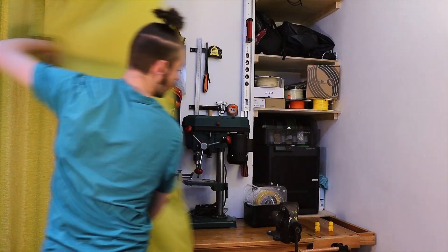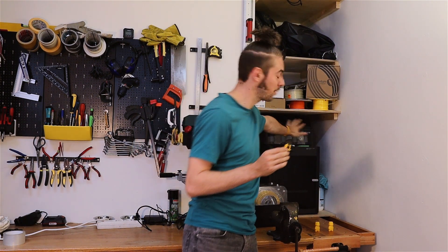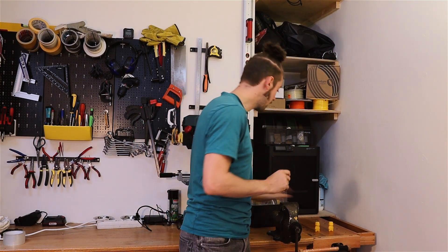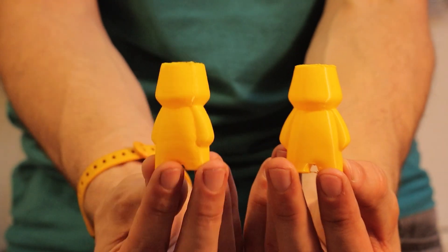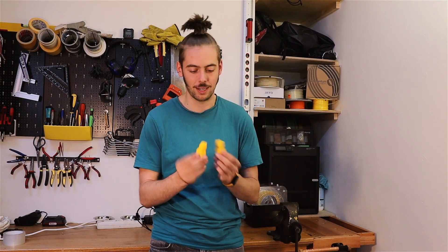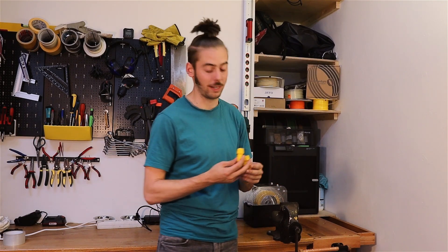My stringing problems got a lot less significant ever since I switched to my new 3D printer, the Bambu Lab. Overall the Bambu Lab deals with TPU a lot better than my Ender, but it's still a little bit of a challenge because it cannot be printed straight from the AMS — instead I need to have it on a separate spool on the side. TPU also needs to be dry in order to print well — it soaks up moisture from the air. This is what you get if you print with a wet spool, and this is what you get with a dry spool. I used to pull it out of the bag, print as fast as I could, and put it back straight away. But when I had TPU laying around for half a year it ended up unusable. Nowadays I print straight from a dehumidifier into the printer, which makes all my prints come out clean.